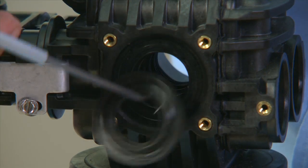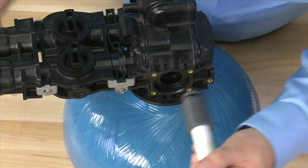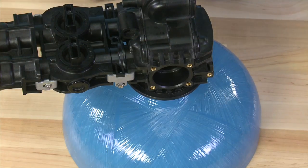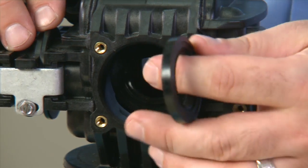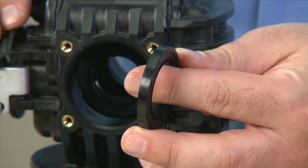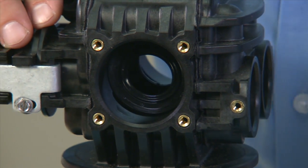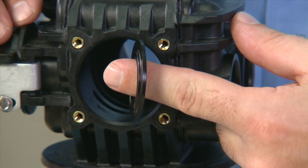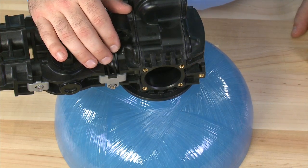We reuse a hook tool for the seals and our puller tool for the spacers. The last spacer inside the body does not have any openings in it, so we want to make sure that we remove that either with the hook tool or with our fingers. Make note that there is still one last seal behind that spacer.